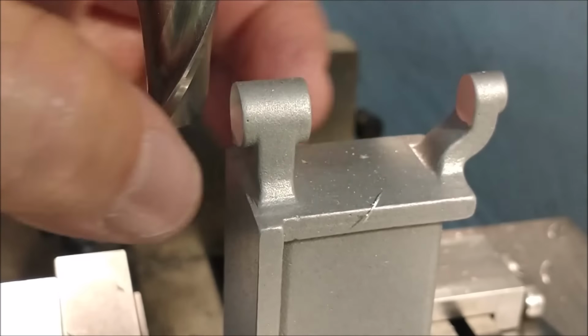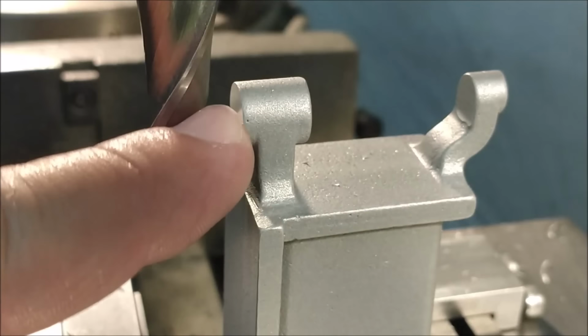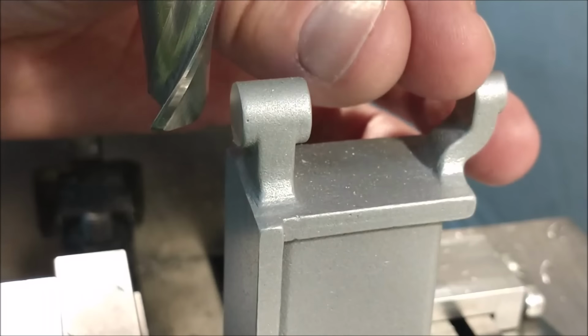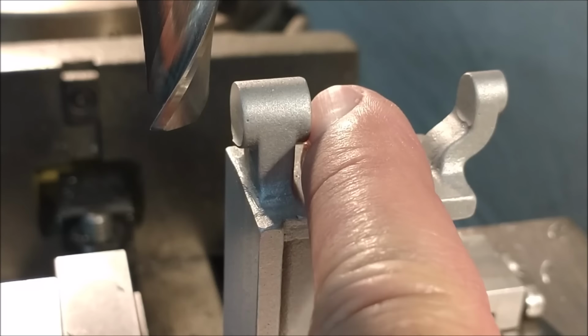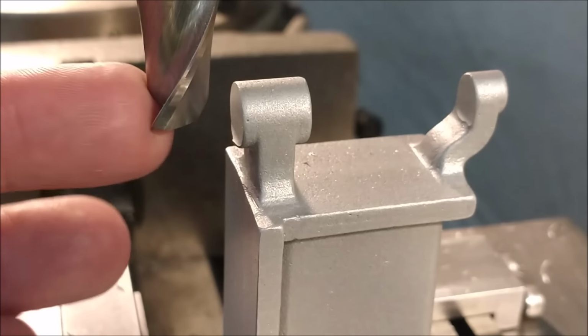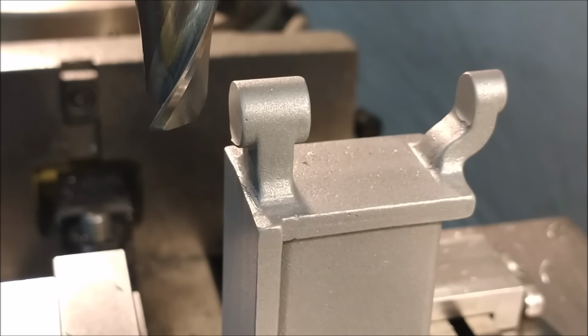With those surfaces complete, and I know there's a part radius here, but I have the cutter set for this height back here and not the front. I'm going to take a visual on that, take a dimensional on that, and I will know exactly which way to go. I recorded the values. This is zero. This is a plus 550, and this is a 1630. For what it's worth, it's a 5/8 cutter. Be right back.